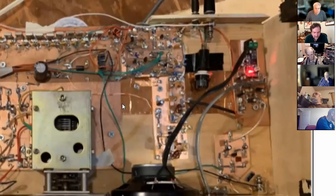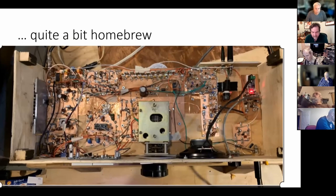So I have a coax question. For doing all those coax interconnects between the modules, it looks like you're just soldering the coaxes. Yeah, right to the board versus doing SMAs or something. I don't do it as neat as you guys. I'm really in awe of your SMA work and your connectors. And I know you have a guy who helps with that, but I think that's a good way to do it, because it makes the modules easier to connect and disconnect.